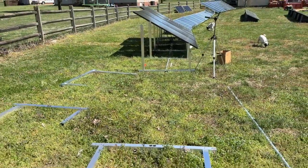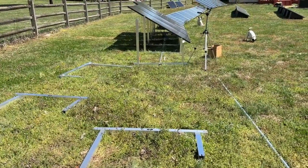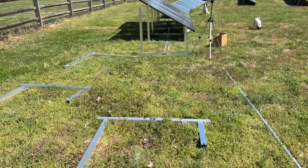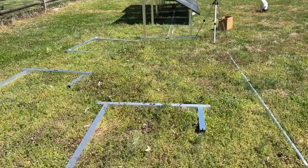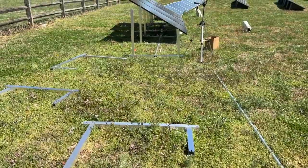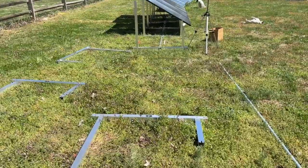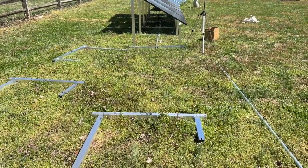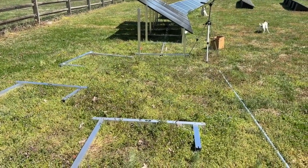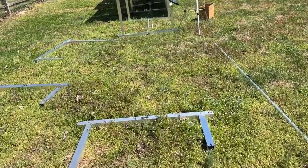You can see here I still have three more racks to set up plus that one that's standing — four racks total — and then I'll be able to mount four more panels. I just wanted to teach you how it's done. I'll record some video clips of drilling and putting in the spikes. I want to make sure the procedure is clear, because if you put everything together first it's really difficult to lift it all up and drop it on the spikes. When it's on an angle it's not vertical above the spikes and you can't tap the spikes through.